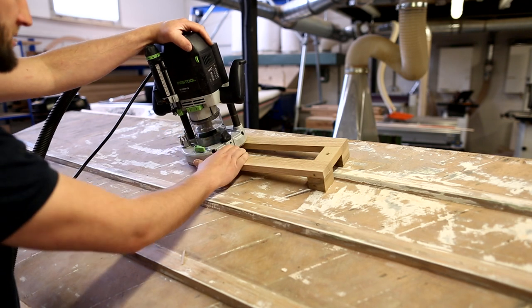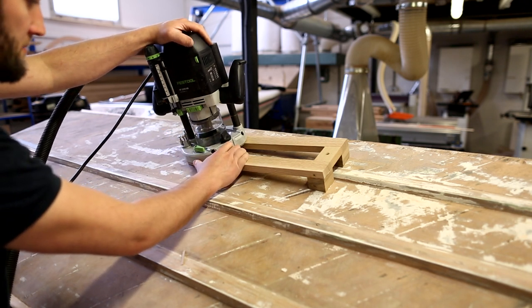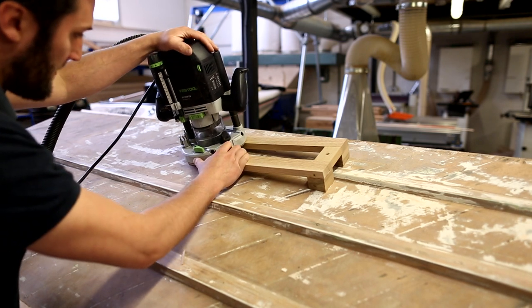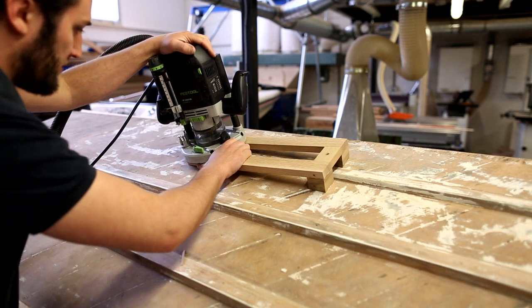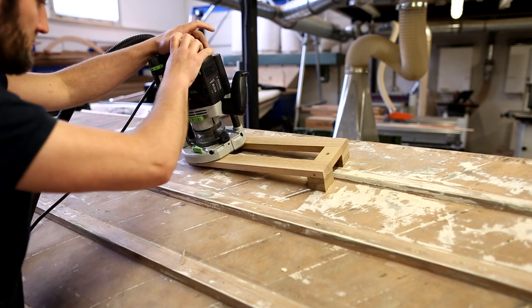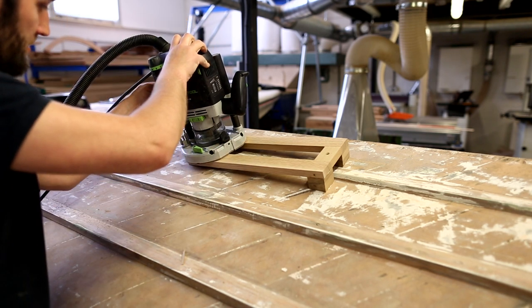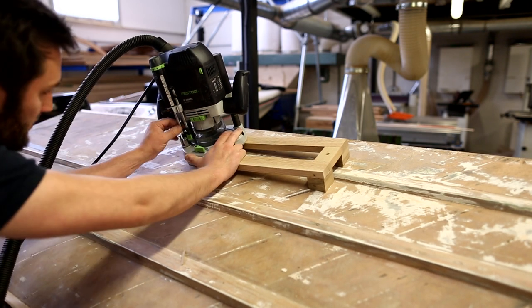This end of the jig is going to be the deepest cut, and so I want that to be just flush with the boat, or probably a little bit above. So what I'm going to do is I've just pushed it down to the end of the jig. I'm going to push the router down until it just catches the surface of the boat. Lock that off,